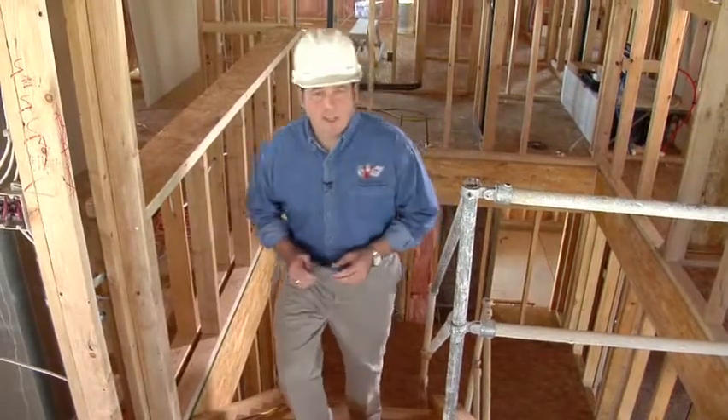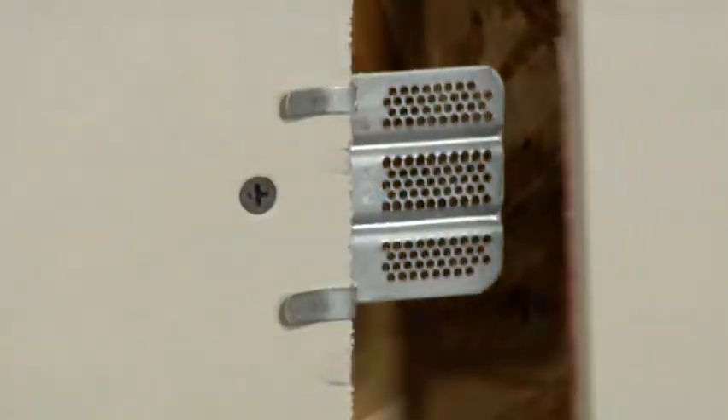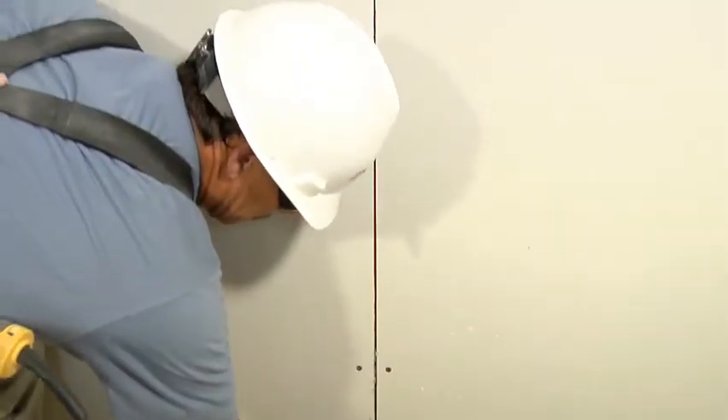Using just the Preston Instaback and drywall screws, you can create a joint between studs that is as strong as any sheet of wallboard. The innovative design allows the Instaback to be used in a variety of situations, from hole repair to ceiling installation. For new construction or remodeling, the Instaback allows you to back-block, or hard-fasten wallboard, four-foot edge to four-foot edge, which eliminates ugly ridges and crowns.